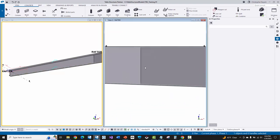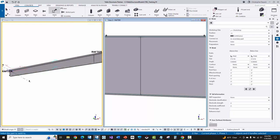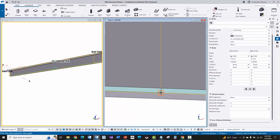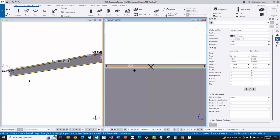Now let's say we want to put in a different weld — a butt weld. I'll go to the weld command and instead of a regular weld I'll do a polygon weld this time: create polygon weld. I'll pick the first web first so it continues to be the main part, then pick the second web to weld to it. Rather than the weld symbol being placed automatically, we have to pick the points to locate the weld. I pick the bottom point, then the top point at the bottom of the outside flange, then press the middle mouse button as prompted, and now I have my weld symbol.